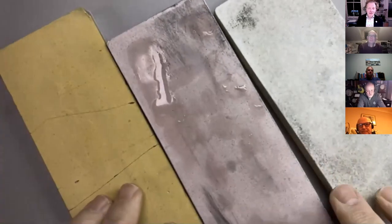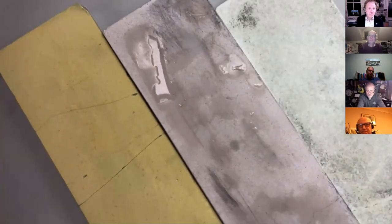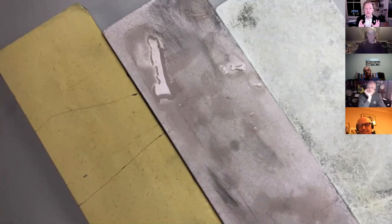Stones, if you had bent the pivot strip, could you have cracked it due to the bending? Is that a worry? Yeah, I suppose so. When you're doing it like that with a piece of bushing wire or something, you can really feel, you know, you get that feeling when a bit of metal has work hardened and it's just about to break. Then yeah, definitely it's worth giving it a bit of a wiggle to check that it isn't going to break in service. I've never known that happen unless you get a ratchet click fail or something in a weight drop, and then it sometimes breaks the pivot off. But yeah, possibly if you bend the pivot back, it could have broken. I've got a feeling, I'll have to look back at my video, but I think that was the one that I've already bent once for the video and I bent it back, but who knows? Yeah, it's always a risk.